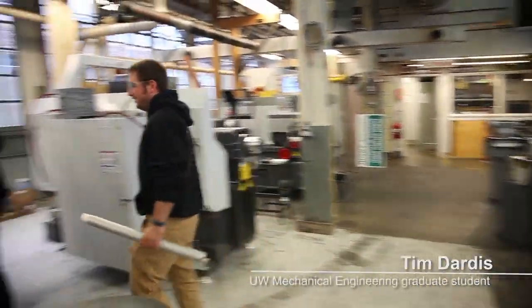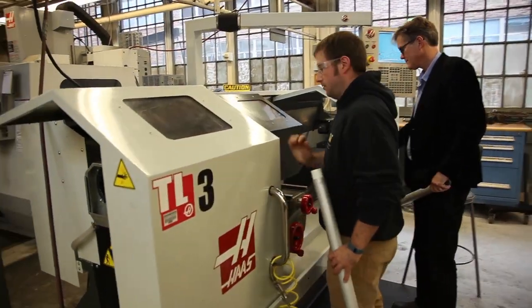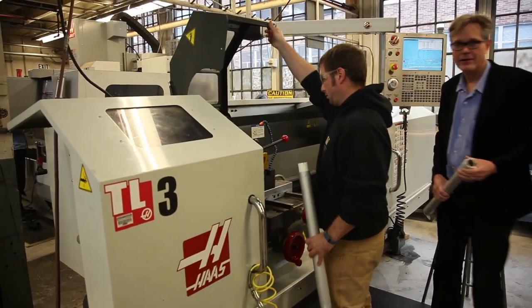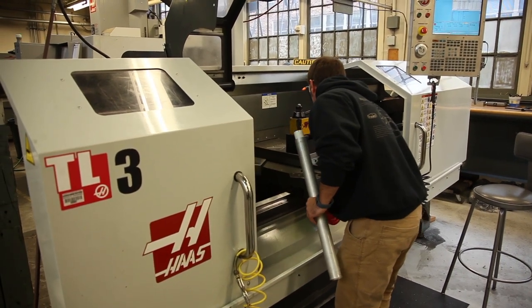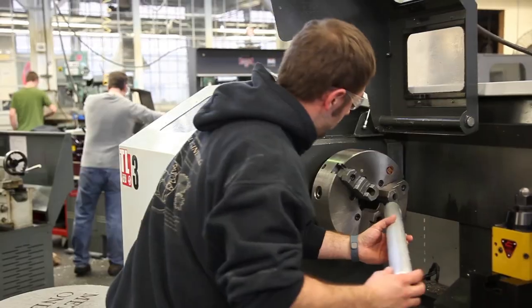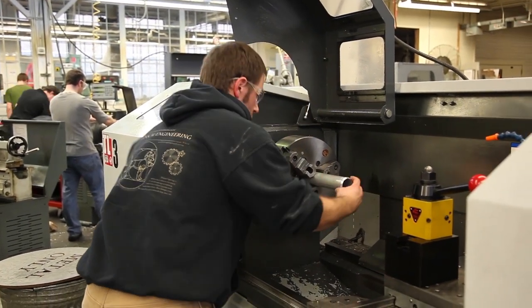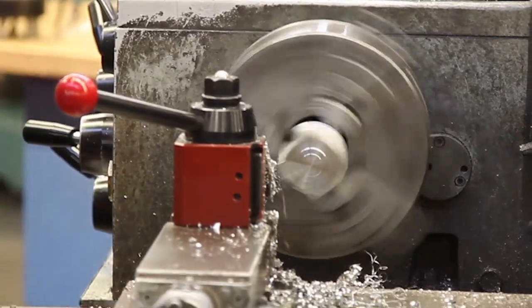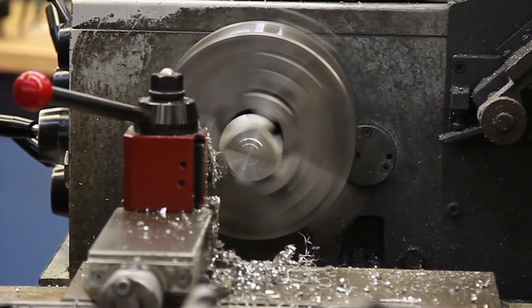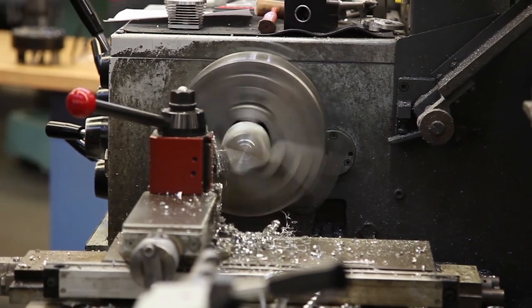Closely associated with the project is my PhD student Tim Dordis. When fabricating subscale piles for testing, there are several components that go together to make such a double pile: the main part is the pile itself — the inner and outer pile. Connected between those two is a spring, and on the end of the inner pile is what we call a driving shoe. What you see me setting up in the lathe right now is the cutting of a driving shoe, which will be welded to the end of the inner pile and subsequently connected via the spring to the outer pile — giving us our entire pile assembly.